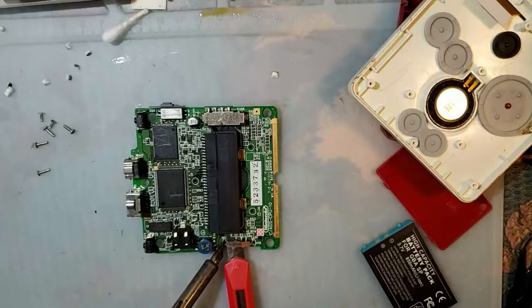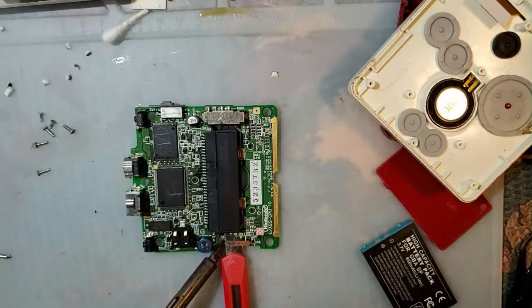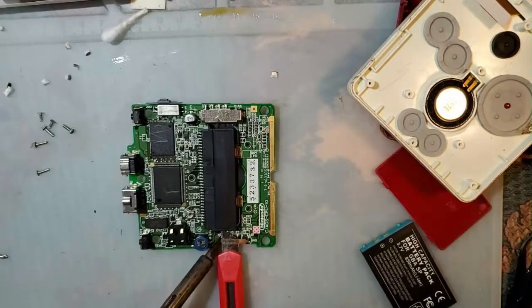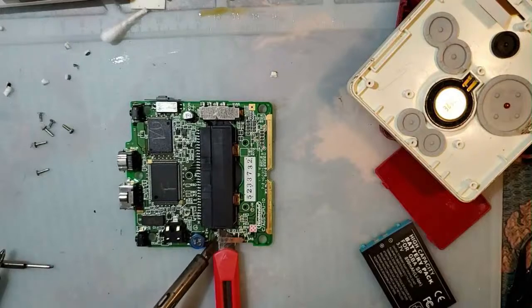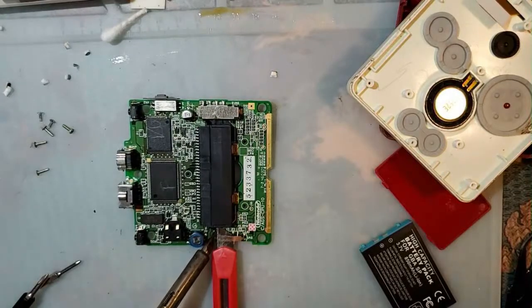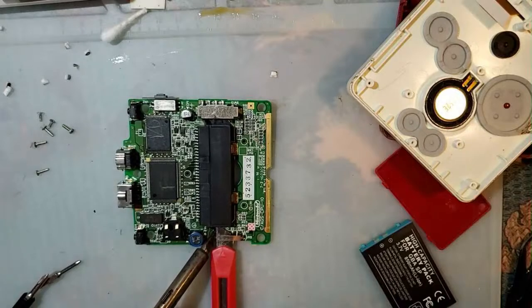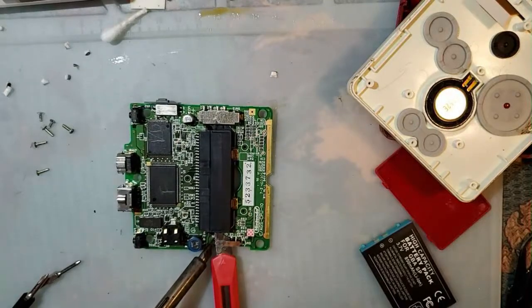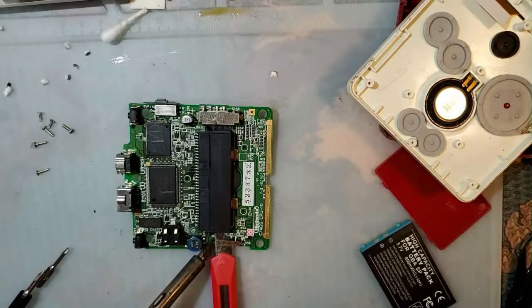See, the thing is, when you're sanding, you're putting all these little micro-abrasions into the material, which is great if you're trying to paint it. But it means the electrical contact area that the system is trying to use is now that much smaller, because it's relying upon all the peaks from all the valleys that you just made.